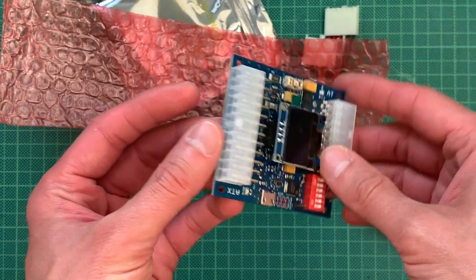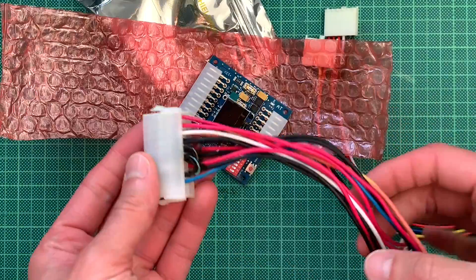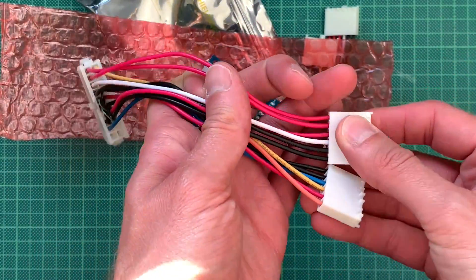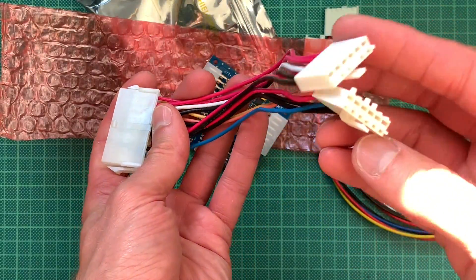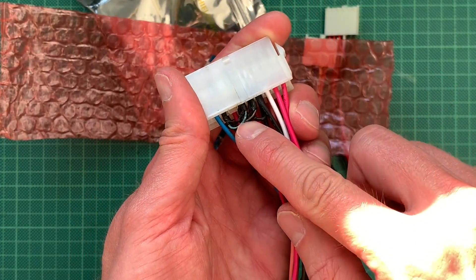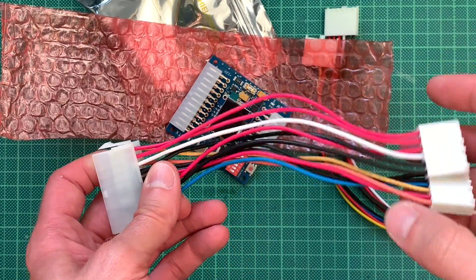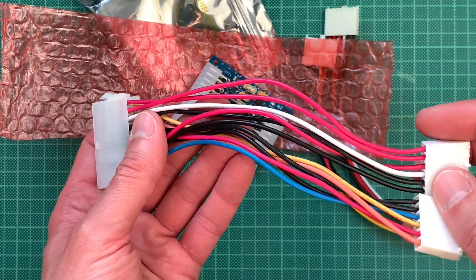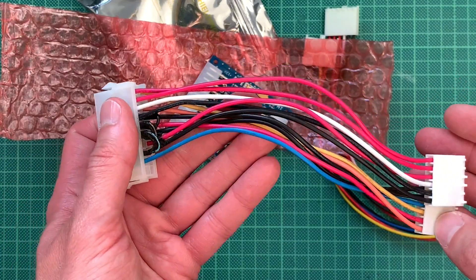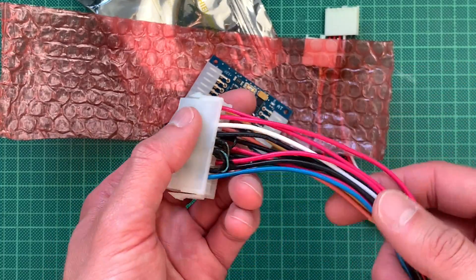What is it for? Why do you need this weird thing? Why don't you simply use one of those ATX-to-AT cables, which look like this? This is a particularly crummy one. Here are the AT-style Molex plugs on one hand and the ATX on this end. It has this very nasty bridge because AT-style power supplies weren't powered on by the mainboard — they were powered on directly by a switch on the power supply. With ATX, the mainboard actually powers them on, so there is a signal going here, and if you don't have that you need to bridge a few contacts, which is pretty nasty.